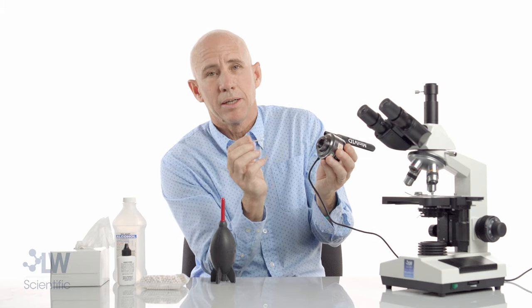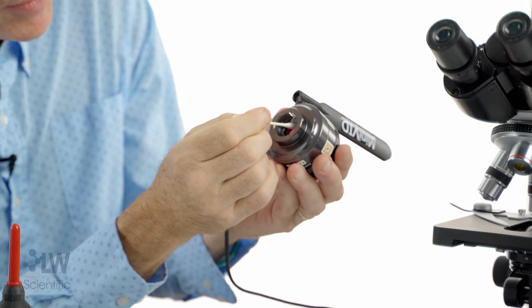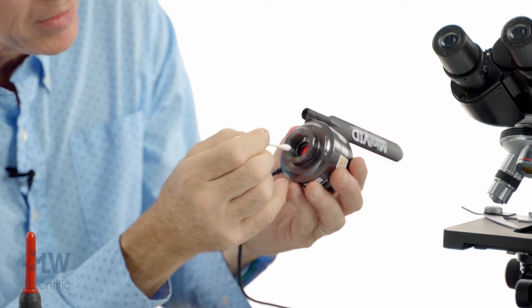This end that I haven't touched — air didn't remove the speck, so I'm going to sweep the floor with clean cotton. I'm going to go right on that sensor in one continuous sweep — one, two, three, four, five — and I've brushed it all off to one side.